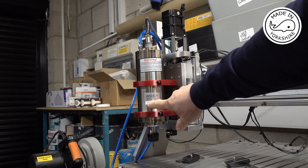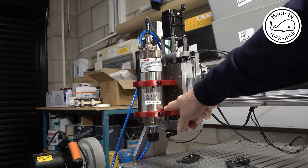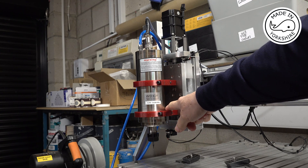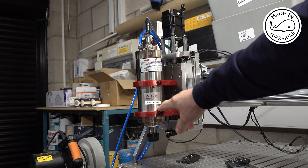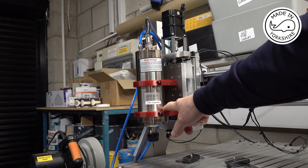And like you see there, it runs from 8,000 RPM up to 24,000. And you're supposed to, if you haven't used it for a week, run it for 15 to 30 minutes at 8,000 RPM.